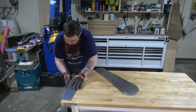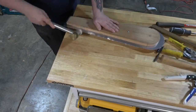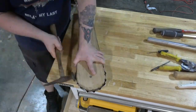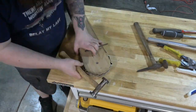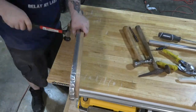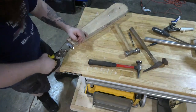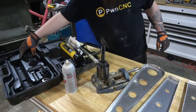I smooth these cuts out with a hand file, then sandwich the sheet between two pieces of oak and go to work with a few different hammers. This is more of a feel thing — you could use just a ball peen if that's all you had. The idea is to keep moving and slowly bend the edge over. The sides will lay completely flat against the hammer form, but the metal around the radius will start to buckle. I use a punch to push this metal into the reliefs and continue working my way around until everything is flat. Next I enlarge all the holes using a step bit and use a hydraulic knockout kit to punch the holes to the size I need.